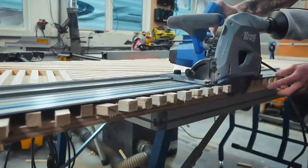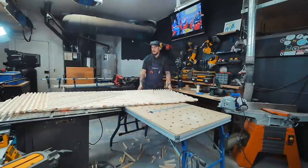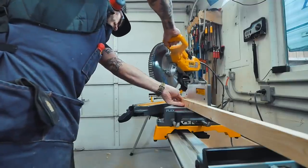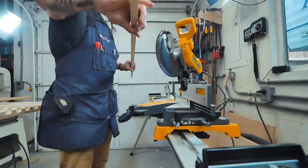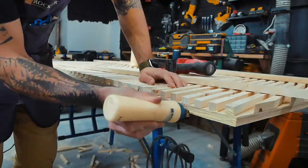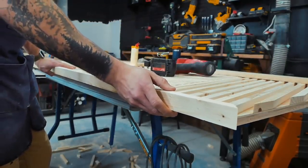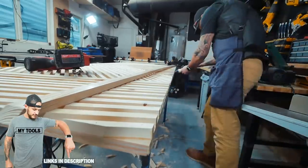When you're finally done assembling everything, use a straight edge or a track saw to trim the door to the actual dimensions you want. Keep in mind you want it to overlap a few inches left, right, top, and bottom so you're actually covering all the space. Now we're ready to frame the door. I trimmed a few pieces down to an inch and a half wide, cut the ends to 45-degree miters, and secured with wood glue and brad nails. I'm using a wood glue bottle dispenser with a brush attachment from Rockler — one of my favorite products. I'll link it in the description.